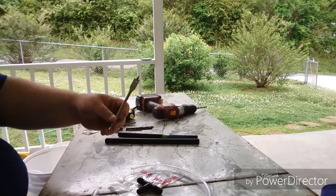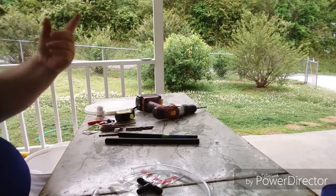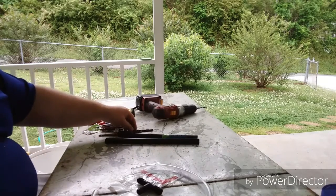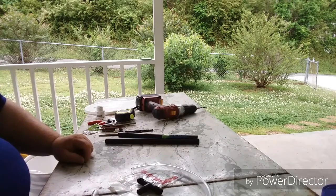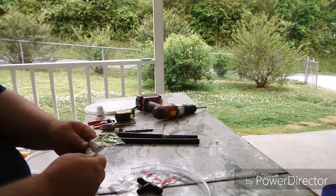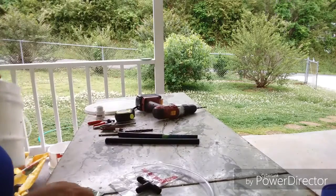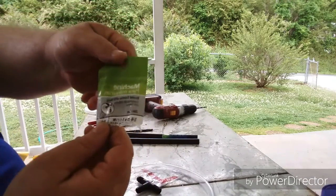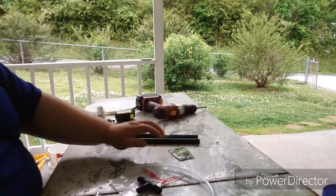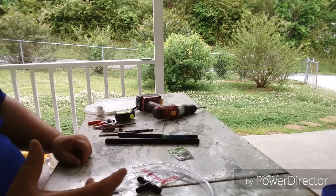Some of the tools you'll need: a tape measure, a pair of pliers, a knife, a 5/8 butterfly bit, and some drill bits including a quarter inch. The quarter inch is for the bolts you'll use, which are quarter inch by inch and a half — they go in the side. You can buy a three-pack at Lowe's for just over a dollar; it comes with three nuts and three quarter inch bolts with Phillips heads.